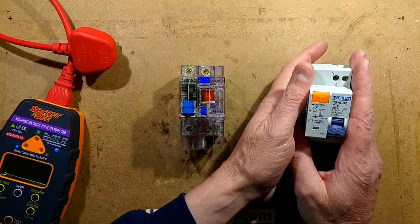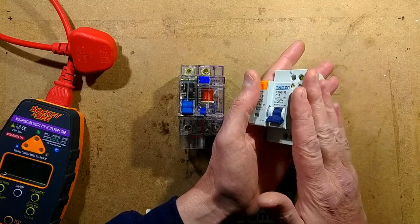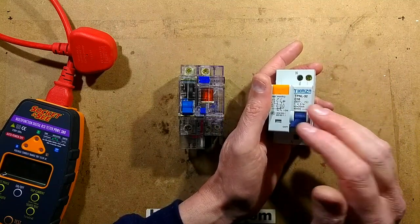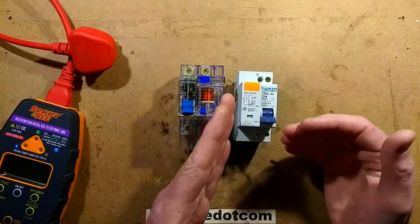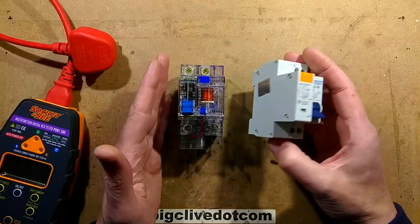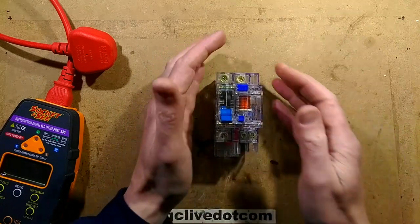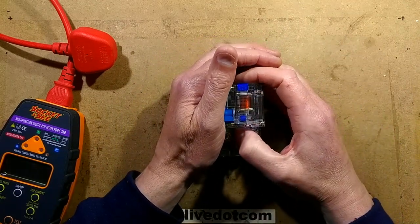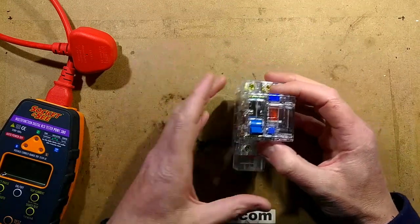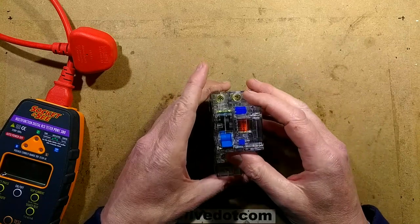Standard RCDs may have a rating like 60 or 80 amp, but that may just be their normal current carrying rating — they may not have the facility to trip if a fault occurs. It's quite dangerous when people use them thinking they're going to break the circuit, because in the event of a fault they will often explode. If you want to see an RCD exploding, take a look at Mike's Electric Stuff — he took one to bits and tested it to the point that it actually exploded and smashed the light fitting above his bench.